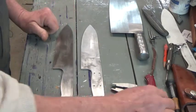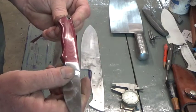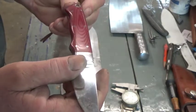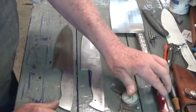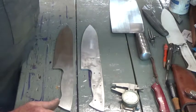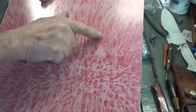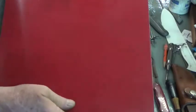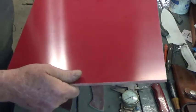On the micarta handle - I got my sheet of micarta in from Pops right on time. I brought this knife into better light than the first video just to show you the grain, and it really shows up. I don't know if you can see that but this is really pretty stuff, and it happens kind of by accident. The linen has a whitish nature, and on the backside of this square foot of micarta you can see some of the white linen at the very bottom layer before they force the phenolic resin into it to roll it into this type of sheet. It has a nice striking appearance and we can get a lot of knife handles out of this.